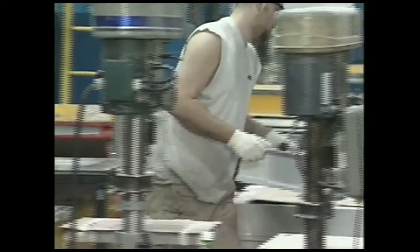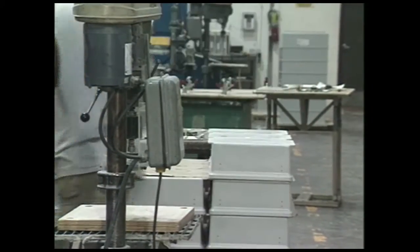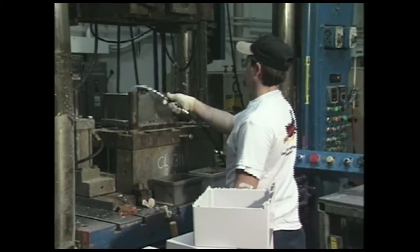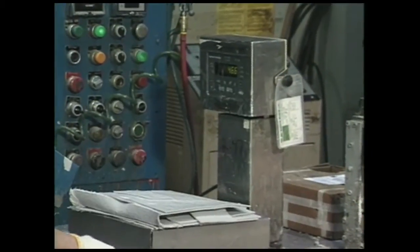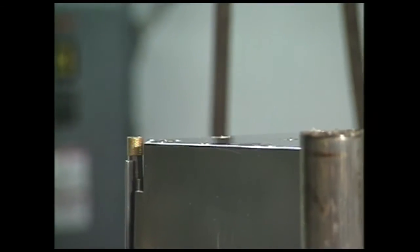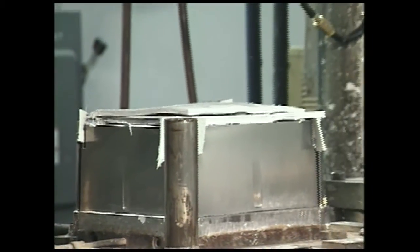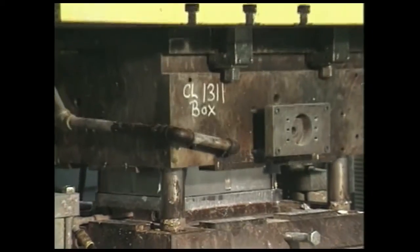The resulting product is now stacked and prepared for further finishing. The press operator begins the process again — blowing out the mold, weighing the charges, setting the inserts, positioning the charge, cycling the press, and performing the post-molding operations on the next enclosure.